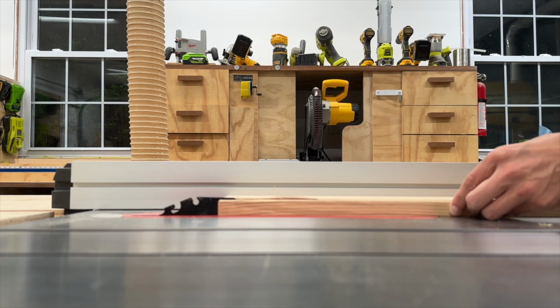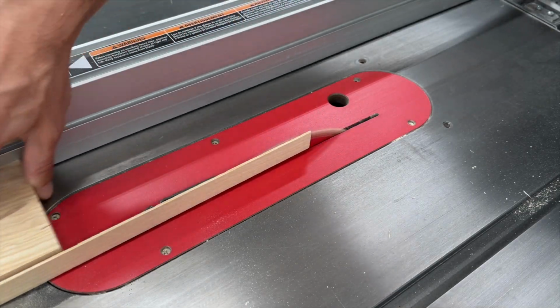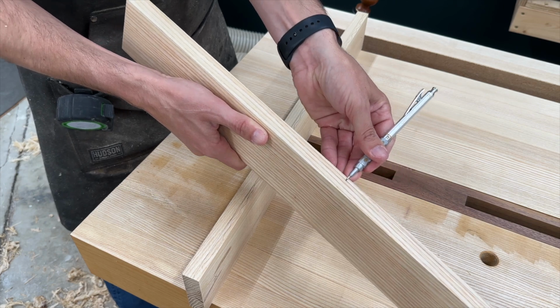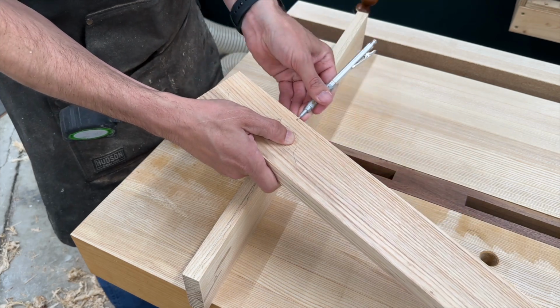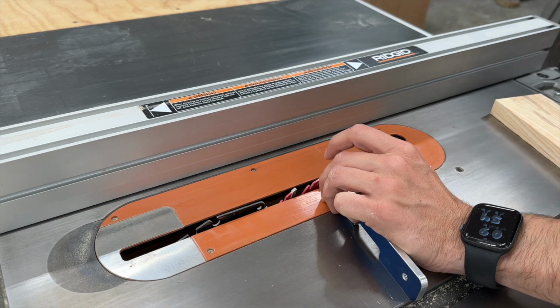It's usually useful to have a contrasting wood on one of the corners for the winding stick so it's easier to tell if anything is out. So right here I'm just laying out a layout line so I don't get the pieces mixed up when I'm cutting. Once dialing in the table saw with a setup block, I could go ahead and run my piece through.